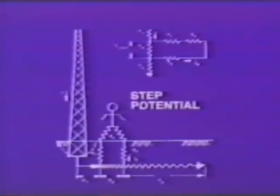This chart basically illustrates the situation. Here we have a structure, a fault current coming down that structure. The jagged line at the bottom of the slide represents the fault current, the voltage gradient radiating outward. You can see the man standing in that gradient. If you look up in the upper right-hand corner of the slide, you see an equivalency chart. Recognizing from this that in this situation, there would very definitely be a voltage drop across that man, producing a current flow. Now, nothing would please me more than to tell you that there's a simple and easy way to deal with this problem, and quite frankly, there isn't.